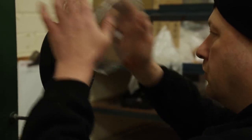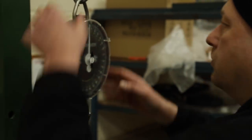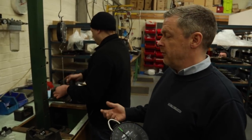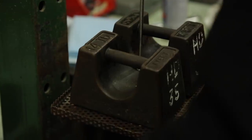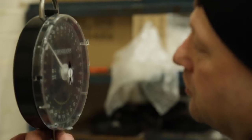Just a small window into the calibration process — this is where a lot of the specimen hunter level products are hand calibrated in order to get the resolution across the range that we're looking for. It looks a little bit hands-on and old-fashioned, but what it does is it allows the guys calibrating to get a feel for the profile of the scale, to balance out the calibration on first and second revolution, and to make sure the product is within tolerance over the complete range.